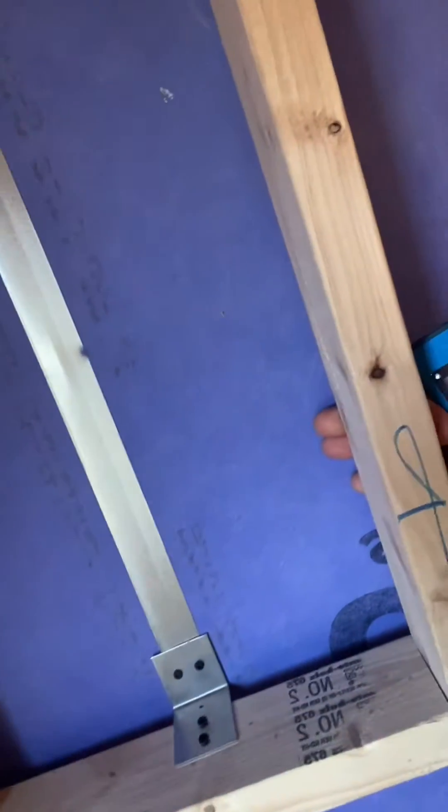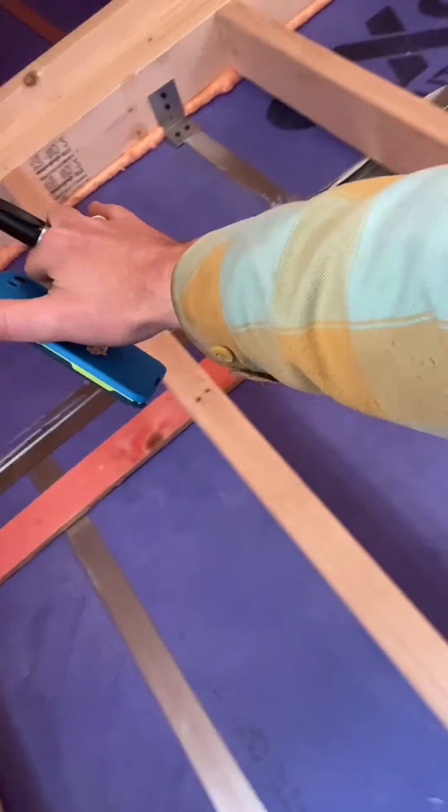Code Coach, talking about firewalls. What you see here again — get your breakaway clips installed, maintain your air gap. I want you to see your compartmentalized maximum 10-foot spaces, all your channels installed properly.